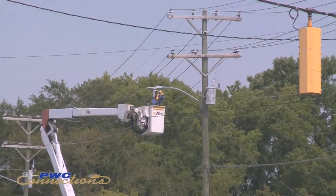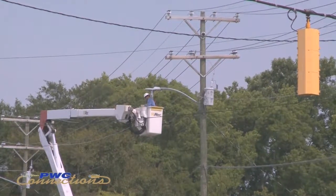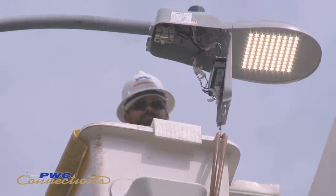In instances where there are lines going around, a lot of times you're not that lucky. You actually have to set the pole naked or bare so you don't have something extra that could potentially hit a line that's hot or energized. A lot of times we'll stand it up, get it set and tamped, so we can work safer.